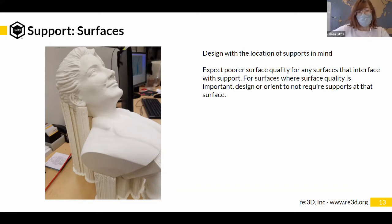This is a good example of striking a balance between different factors. You did want to get that good surface quality on the face, but to do that you had to have more support, and that translates into longer print times and longer post-processing times. But in this case it was worth it because of the priority of getting a good surface finish on that face.